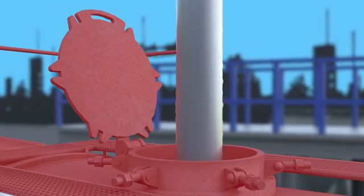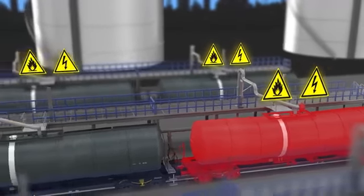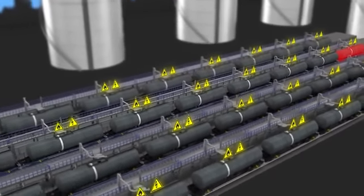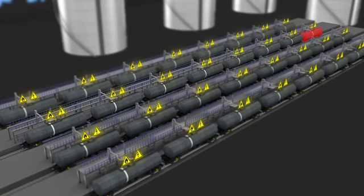As a result, a voltage on the railcar will be present and increase during loading. If allowed to increase to a high enough level, a static spark could occur with enough energy to ignite flammable atmospheres in the loading facility. If this spark discharge were to occur through a flammable vapor — for example, from the manlid to the loading arm — it could easily cause an ignition resulting in a potential fire or explosion, putting the lives of operators and plant assets at risk.